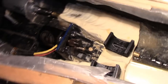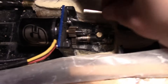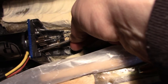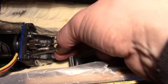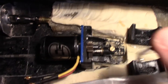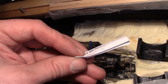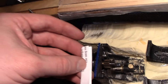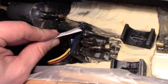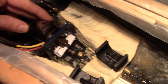I have the drive motor just about set. One thing spacing-wise I didn't do a great job on — to get an Allen key in there relative to where the solenoids are, there's not a huge amount of spacing. Fortunately I have a cut-down one that fits. To set the spacing between the gears I'll use paper — I have it folded up so it's three layers thick. I'll put it through the gears, push them together, and then torque the motor down. Then I'll rotate the gears to pull the paper out and see how the spacing is. I have the paper in and the motor torqued down.